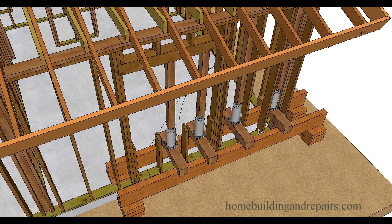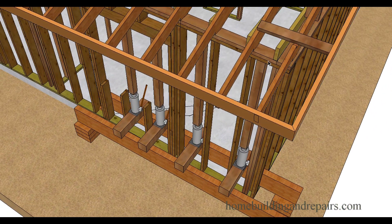How many jacks are you going to need? Do you need to put a jack every 16 inches or every 2 feet? It depends on the amount of weight you're supporting. The jacks are underneath the wall — these two support posts are underneath the header and these two are underneath the wall top plates. When everything is set up, raise it just a little bit at a time — maybe a half inch at a time. You might raise one area an inch, another three-quarters, another a half inch, and another a quarter inch depending on the situation. Do it in small increments.